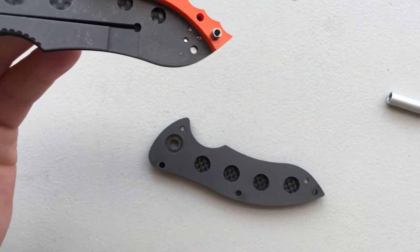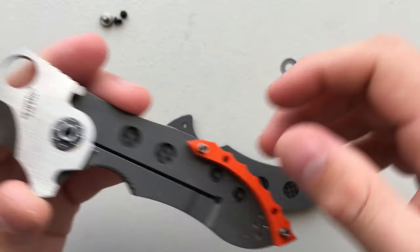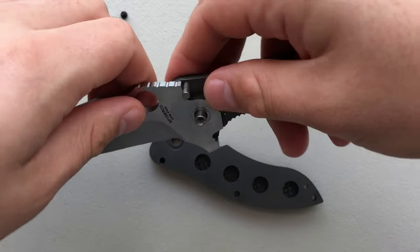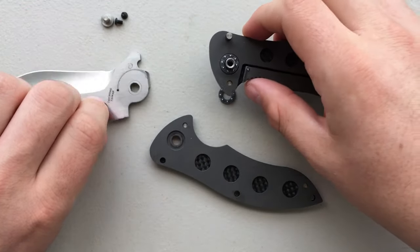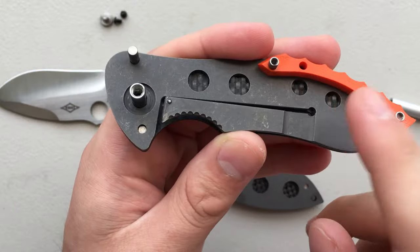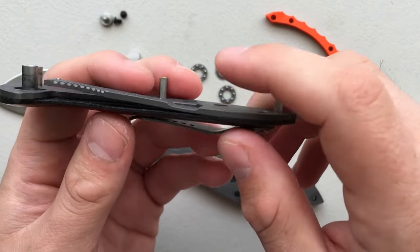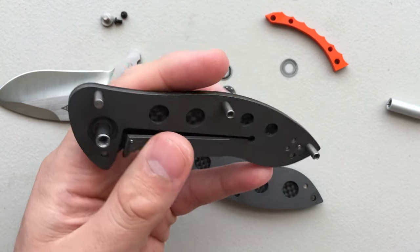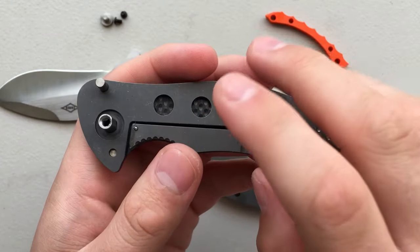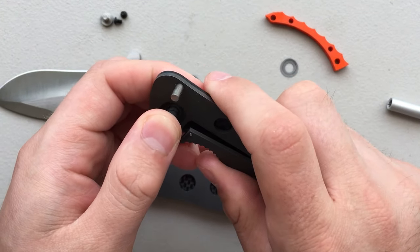The fact that the race has got some wear on the back of it — wow, the thing's really light — is implying to me that this needs maybe a little bit more lubrication, because the bearing race itself is spinning as well. I'm gonna pop that off and very carefully lift the blade off. Yeah, this could definitely use a little bit of cleaning. Because the liner here is titanium, which is nice, I can just lift this off too. I've got no need to disassemble this guy further — it's not like the titanium is rusting away underneath the carbon fiber.